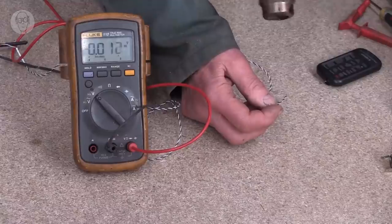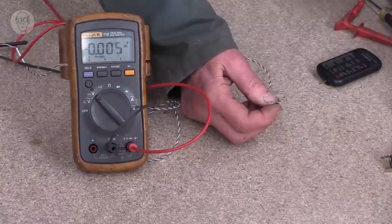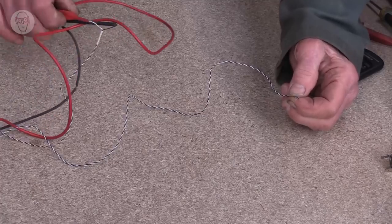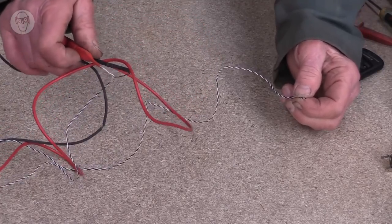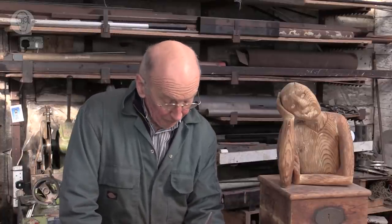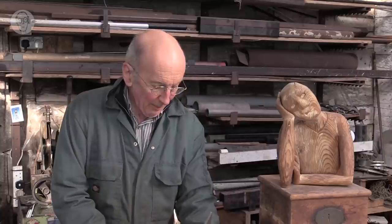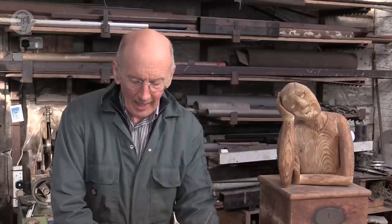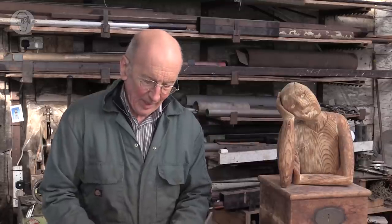And this voltage is very accurately proportional to the temperature. It's actually the temperature difference between the tip and the end of the wires, the other junction, if you like, where it joins onto the multimeter. It's an old effect called the Seebeck effect, but it's very widely used for measuring temperatures because it can measure up to extremely high temperatures, and with different metals over different ranges, and extremely accurately too. Of course, the voltage it creates is very, very tiny, so they have to be used with special controllers to convert them into complete sensors.